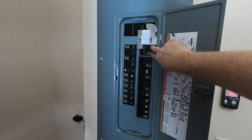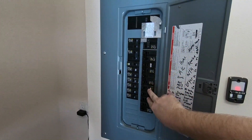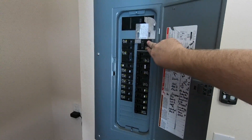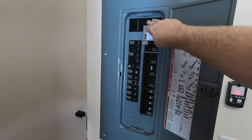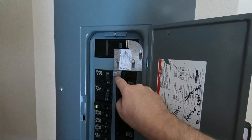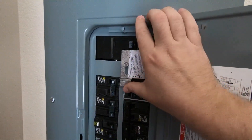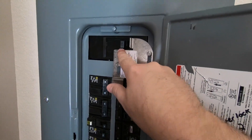I'm not going to do it right this moment — you can check for further videos later on. But what you would do is slide off your main, which would allow this to travel up because the main will be over here. This travels up, and this breaker is now allowed to be turned on. Before you turn this on, you would shut off all your other breakers, slide this up, turn this breaker on, and then individually pick which items or areas of the house you want. Just down below there is where I have the Generac breaker for the cord, as you can see underneath it here.